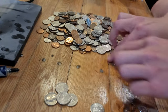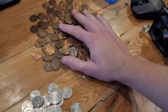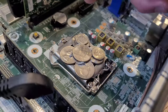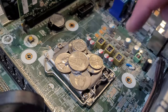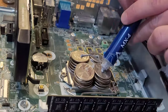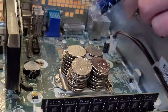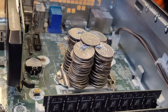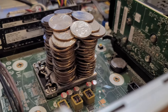I then sorted the coins to give this video the illusion of organization. We've got a bunch of pennies I'm probably not going to use, a couple of nickels I'm probably not going to use, some dimes, and a bunch of quarters which will make up the bulk of the heatsink. I decided to build it up starting with a layer of four quarters, then one quarter in the middle surrounded by four dimes on the sides, with this pattern alternating all the way up. I layered coin with thermal paste with coin with thermal paste until I reached a respectable size. The only issue was that quarters were thicker than dimes, so in some places I had to use two dimes to level it out. Eventually I ran out of dimes and just used up the rest of the quarters in a similar fashion. The final product is made out of dimes, quarters, and a couple of nickels — relatively structurally sound.